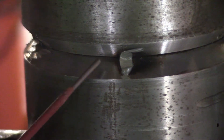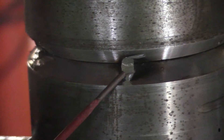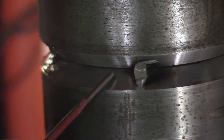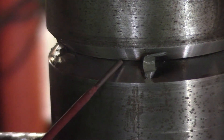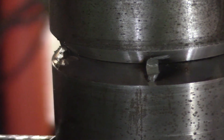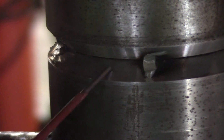All right, this is a common problem. I just did my first 6010 pass, and you can see this tack right here broke. It didn't spread out very much, so I'm just going to fuse it back in with a TIG welder. But if that happens, sometimes you have to clamp it back together with a C-clamp or something and suck it back together, because your fit-up is essential for this to work out well.